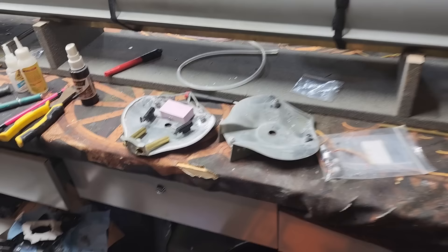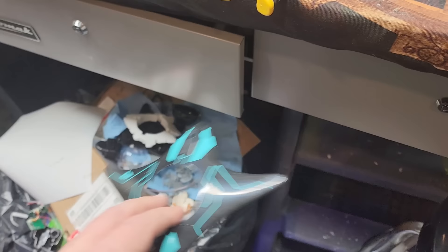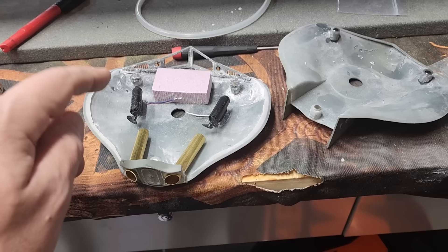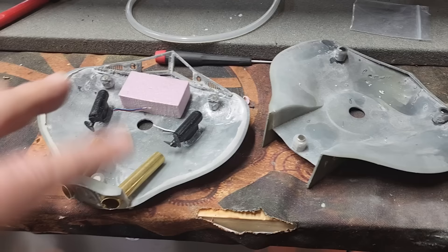This is the beginning mock-up of the 1/60th scale flying sub. You guys remember this thing I got off eBay — it was fun, but I don't need toys. So I took it all apart, saw how it worked, and salvaged these little brushed sealed motor pods. I think these are going to work really well — they propelled that other thing along really quickly. These are sealed, and I've got an electronic speed controller that actually has dual motor capabilities, so a single ESC will handle both motors for differential thrust.